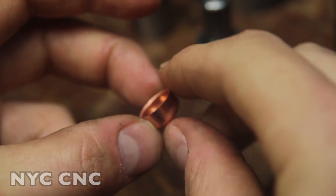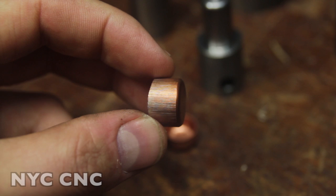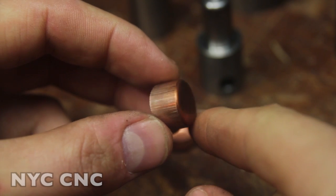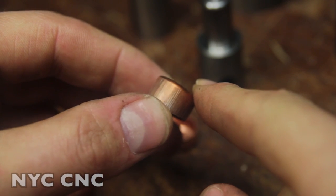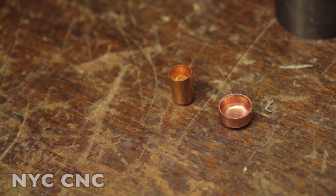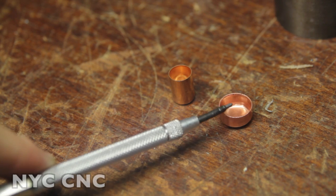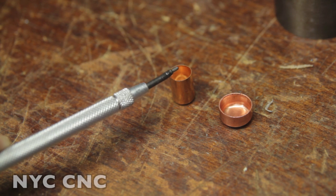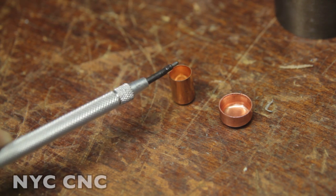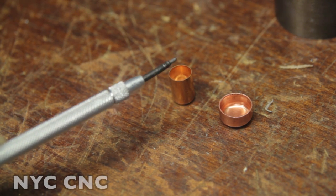And if you compare it with the last version I made with the aluminum dies, it had a lot of streaking from the aluminum, and just, it wasn't bad, wasn't quite as nice. So that's a wrap for this series. I am going to make the drawing dies to bring this down to the 352 or so we need for a proper 9mm jacket case. If you guys want to see the video series on that, comment below, let me know. But we're going to call this series a wrap.